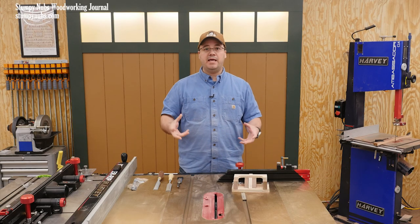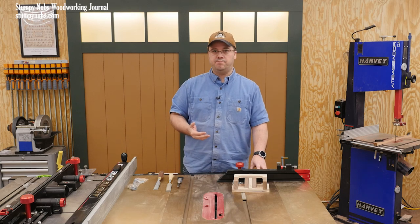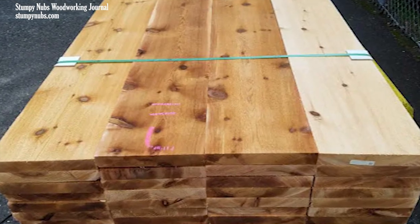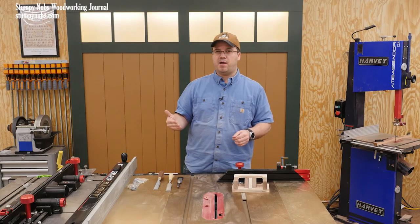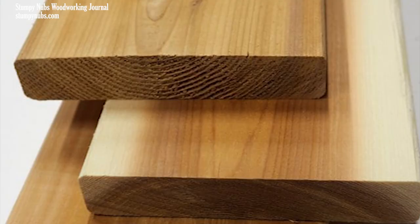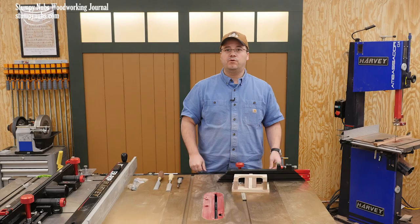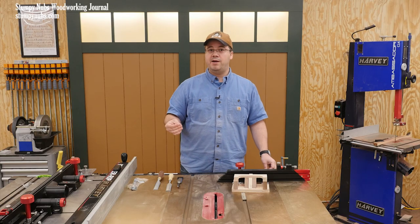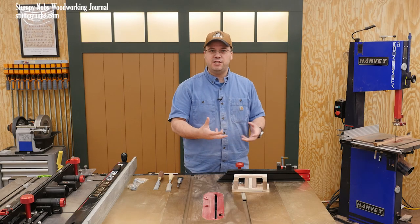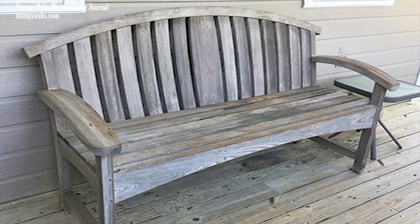If you don't want to encase your outdoor project in paint, you might consider a wood that has some natural resistance to decay. Cedar fits that bill nicely. It comes in several varieties, so the type you'll use is likely going to be determined by what's available in your area — western red cedar is pretty common where I live. Cedar is beautiful when it's fresh but it will inevitably gray over time no matter what finish you put on it. Since that natural gray patina looks a lot better than an aging flaking finish, I recommend just leaving it bare and embracing the color change. It's going to last you for decades.